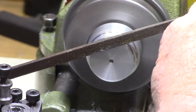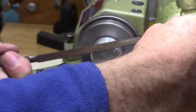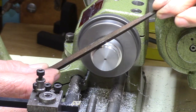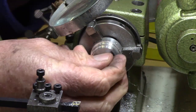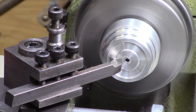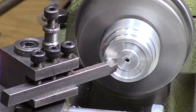I am starting to file the profile on the tread. I did this by using the calibrated eye and the existing piece of the broken casting that I had as a template. Here I am filing the correct profile on the flange using the eyeball technique.